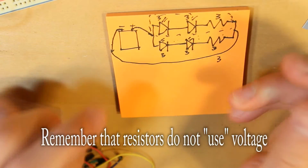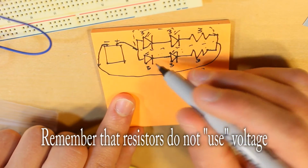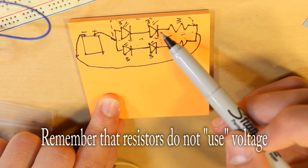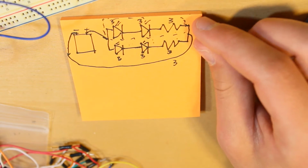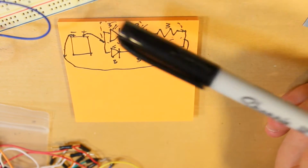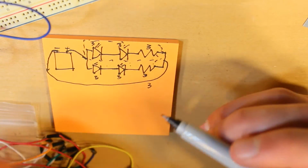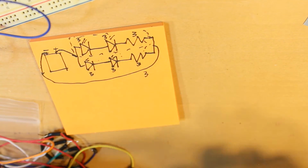That won't be affected. We don't have to double voltage for parallel, just amperage. So since this circuit is essentially the same as this, we don't have to change any resistor values. We can still use our same resistors. All we need to do is in parallel add another resistor. One thing to note about this though is that sometimes it won't work with more than like 2 different colors depending on your resistor values, because some colors draw more amperage, but usually if you have the same resistor values, then you'll be fine with what you're doing. If you're using 2 different values, then the calculations become very complicated. So we're going to stick with same color, same current draw, and same value resistors, and we will be fine.